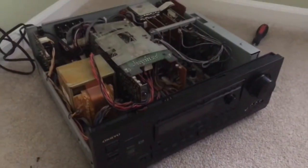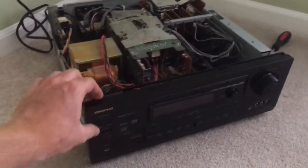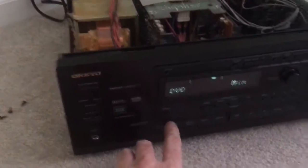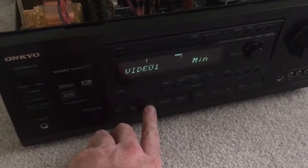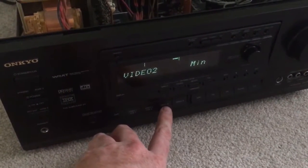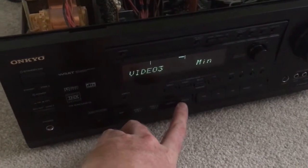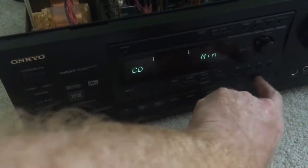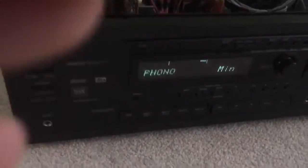Now in terms of the behavior of it: when I turn it on, the display portion works fine. Every button I press works — you can hear that, and we'll go into more detail on that. Switching the audio mode, there are relays over here and I'm going to start switching modes. As you can hear, the relays are working fine.